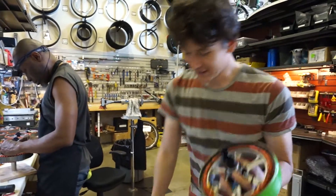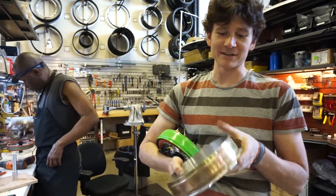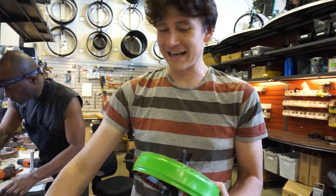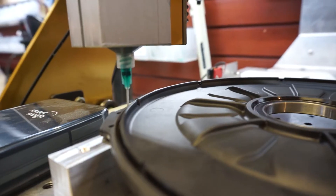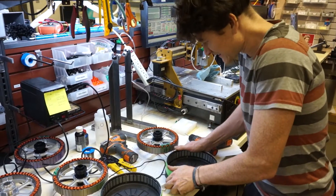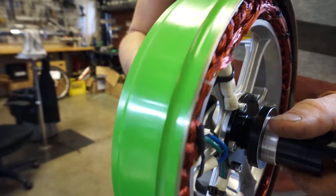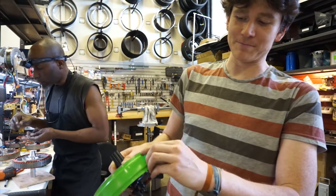When we build these motors, what we do is bond the magnet ring to one of the side cover plates with a super strong thermally cured epoxy adhesive. The side cover holds the magnet ring nice and circular so that it can be assembled and disassembled without the ring collapsing from the magnetic force. I went ahead and after painting these things green did the epoxy bonding to the side cover plate, expecting to assemble the motors fairly easily during a normal Grintec motor manufacturing process. But the moment they snapped together, the impact forces literally pulled the side cover right off the ring — the epoxy and the paint had effectively fused together into a non-cured mushy mess, and it stripped the paint right off the side of the ring.